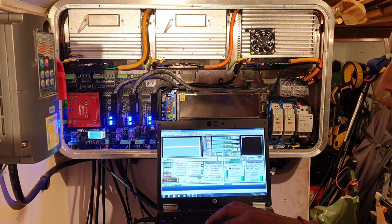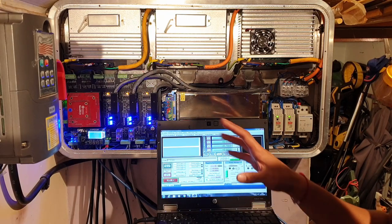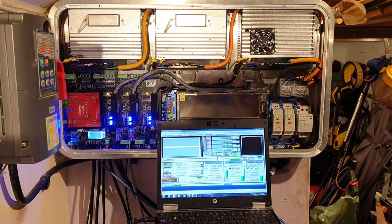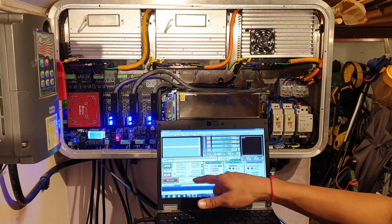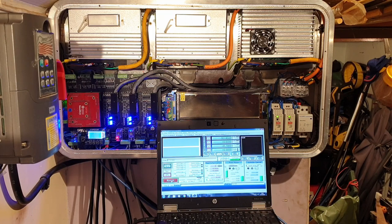And yep, everything's fine. So when I click reset, you can see my enable lights on my servo drivers all go on. And then I can control my axes. So I've got my e-stop all wired in. So if I go ahead and hit that, it's an active low. So you can see the blue light just went off, and then it's just shoved Mach 3 in the reset mode. I can't reset Mach 3 because obviously the e-stop is connected, but if I unclick it, I can go